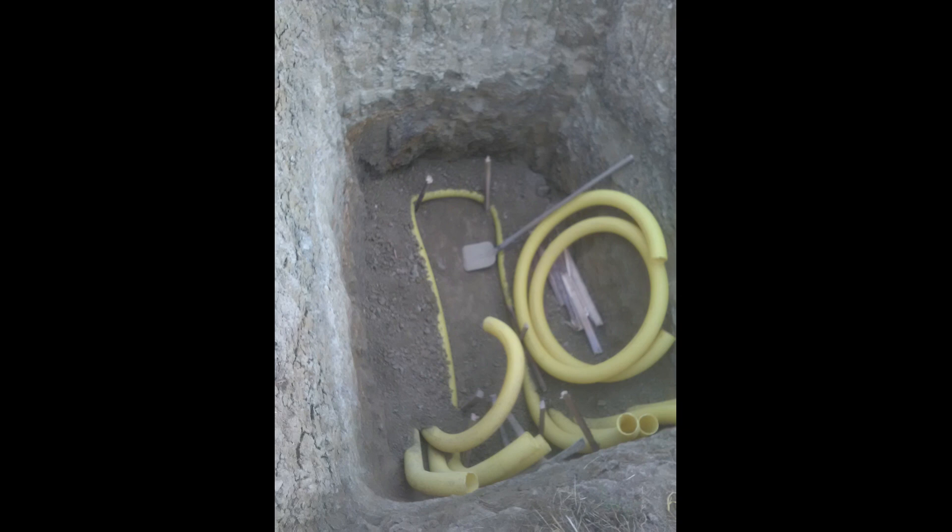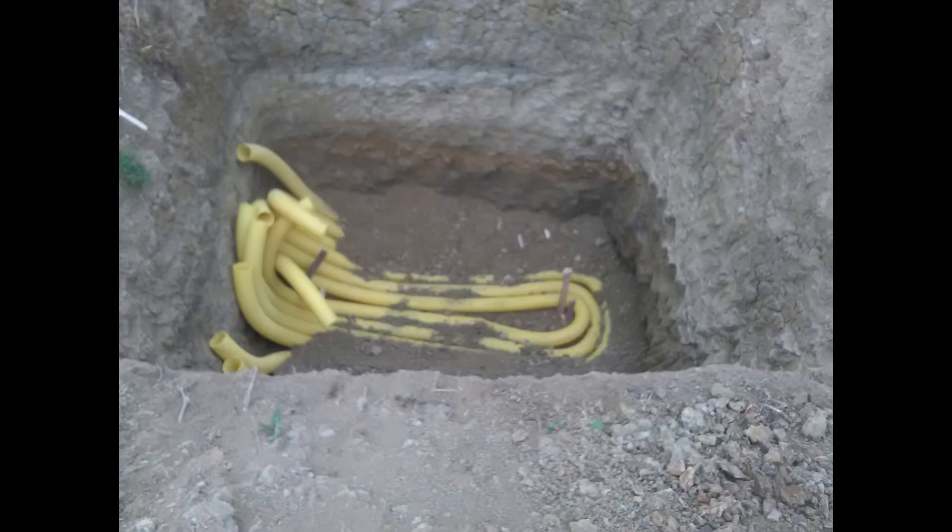I divided it 50 times and from that I got that I need 50 meters long and 100 mm wide prefabricated drainage pipes. Somebody is suggesting to divide it just 10 times but that will not work — it is too long to be possible to circulate air in such a long tube system. You will lose too much static pressure.